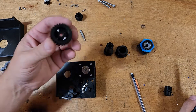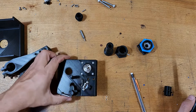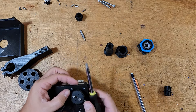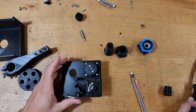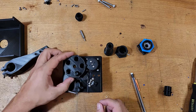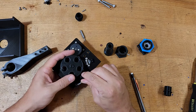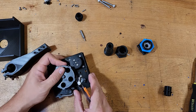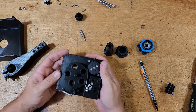The next part to put on is the gear. You'll see it's recessed; I've already put the screws in it, and you just need to line up those with two of the holes on the motor flange. Once the gear is on, we just need to drop in our feed wheel. We push the cam out of the way and get the feed wheel lined up with the gear. What we should have is something that looks like that.